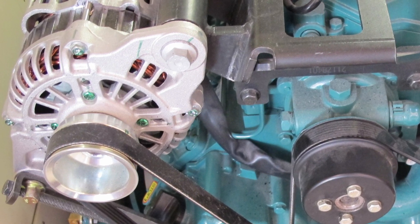The same goes for alternators, because they're a source of power. Although, here there's a minor difference between the ABYC and the ISO. The ISO says if that alternator is wired back to the solenoid on the starter motor — which it is with all engine-installed alternators — and that's less than half a meter in length, it doesn't require over-current protection. But if it's not, and if we put a high output alternator on there wired to somewhere else on the boat, then they require over-current protection. The ABYC says, once again, if the ampacity of that conductor is higher than the maximum potential output of the alternator, we don't need the over-current protection.